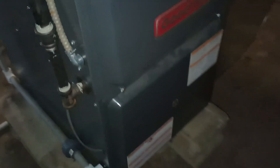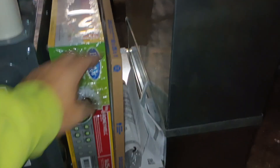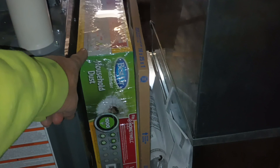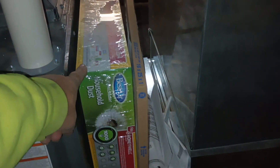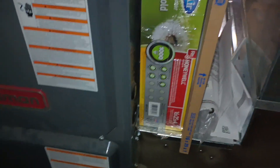I will spin the pre-doped dirt leg up through a union on the condensate drain for future service and also a flushing T. It's internally trapped so I don't need a condensate trap or a P-trap on this one. For now, until I get all the garbage worked out of the ductwork, I just have a one inch pleated air filter, and then once we get the stuff moved around and the dirt circulated, I'll throw the four inch — it's a 16 by 25 by 4 pleated — and that's going to take a lot of dust out and keep it out.